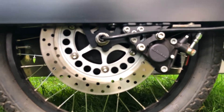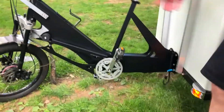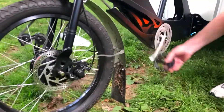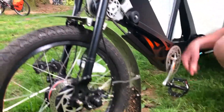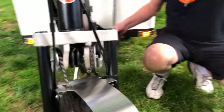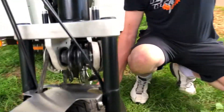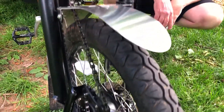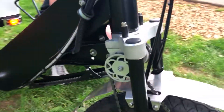In the front we have front wheel drive human power, which is really unusual. As you can see, the chain is going to the front wheel from the pedals. We have a sweet little universal joint mechanism in there that allows the power to transfer through even during turns without any chain twists. That basically solved the front wheel drive problem and allowed us to create a modular system.